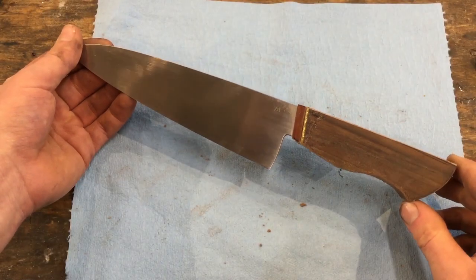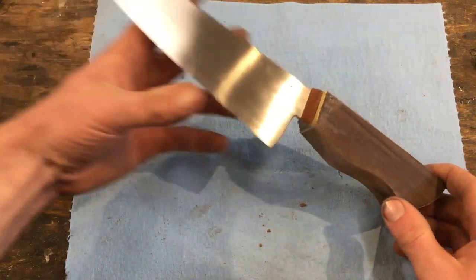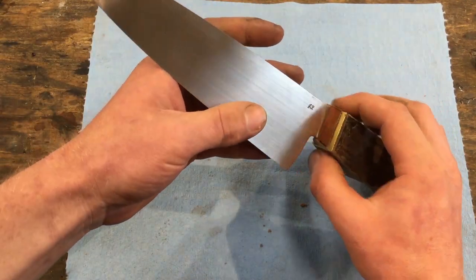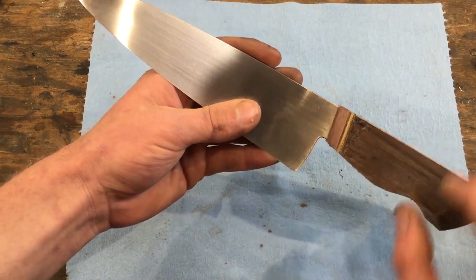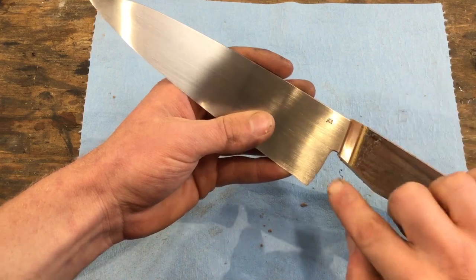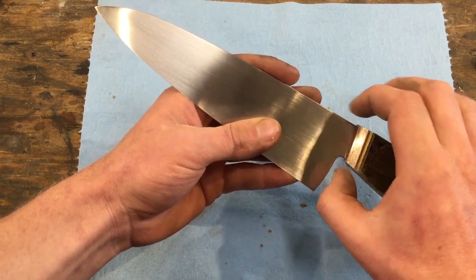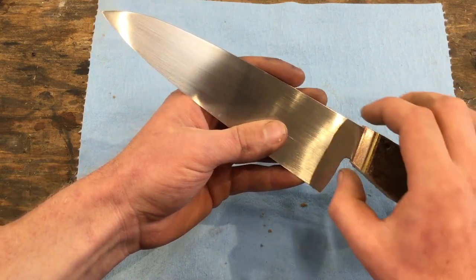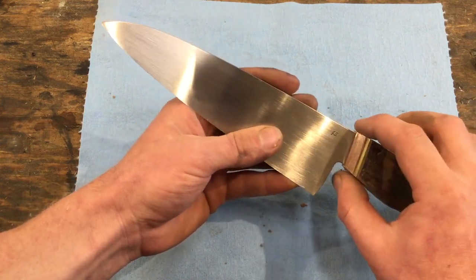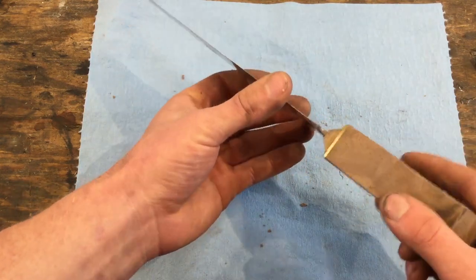So here I've ground the handle to profile. I left the profile ever so slightly oversized where it meets the ricasso. You notice that there's a tiny little bit of step here and here before it meets the blade. And I find that to be very attractive visually, but it's also very functional